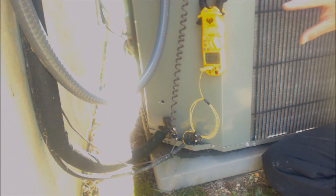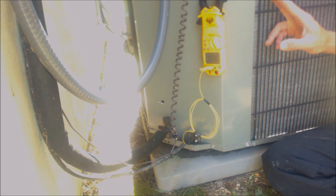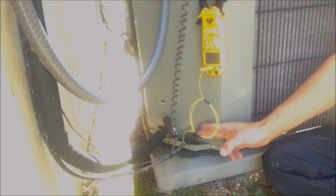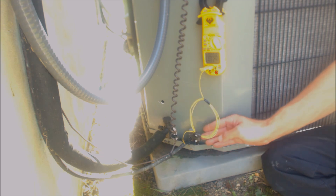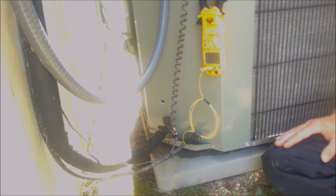The saturated temperature is found in the middle of the saturated state in the outdoor condensing coil. We usually check it on the gauge port and convert it to saturated temperature. What I just did is put the probe into the coil, but you have to know where to put the temp probe into the coil.